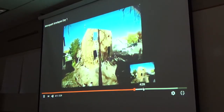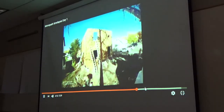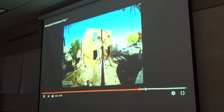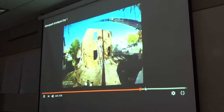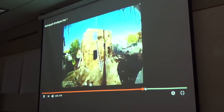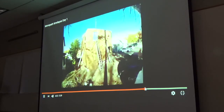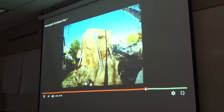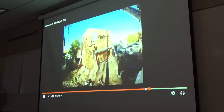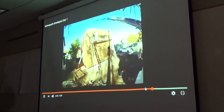And the screws and nails are meant to go in from the outside. Correct. Do you have like 5 guys pushing against that panel when it's being screwed in? Because you're screwing through the fixed member and into the loose member, where you would prefer to go the other direction, unless you've got a lot of resistance. You're using a set of screws as clamps. You don't need any back pressure to do that. They'll pull together. They're temporary. You've got to back them out. That's the one trick there.